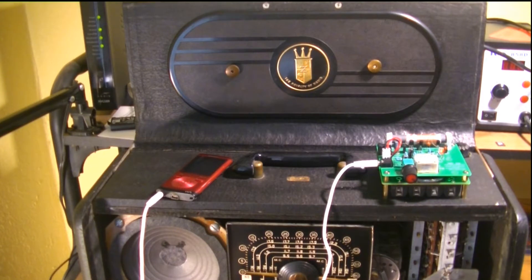You can also track the — if you're testing a radio, like this is an old Zenith, the G500 Trans-Oceanic — it doesn't receive it at all because I haven't aligned it yet, and I didn't have anything to align it. That's why I bought this transmitter so I can try to align it. This would be my signal generator. So I'll demonstrate me tracking the station through its entire range.